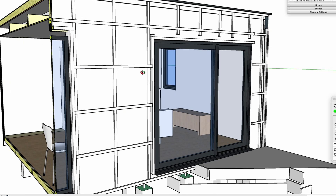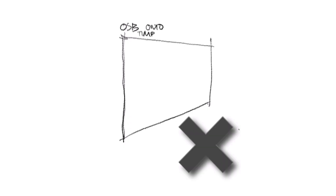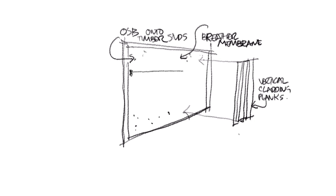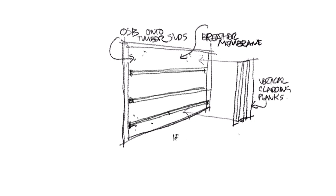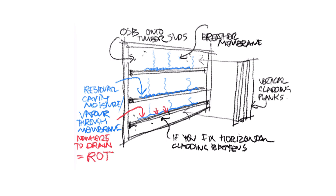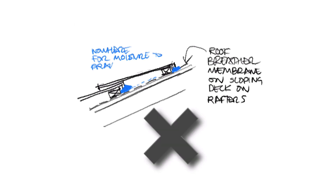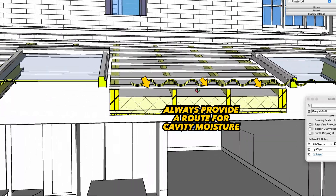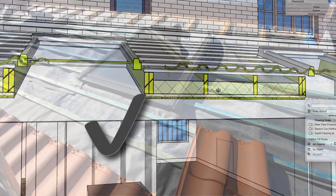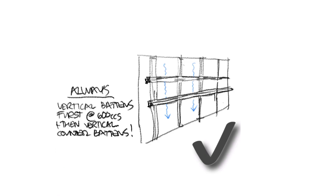Cedar and large boards will especially suffer from this gradual creeping problem — you won't see it until it's too late. Related to this is rot within the cavity battens. If you're using vertical cladding, you need battens on counter battens; otherwise that cavity moisture will get stuck where the horizontal battens are fixed to the breather membrane and the OSB. I've seen many YouTube videos of supposedly experienced tradesmen not using counter battens for the rain screen battens.